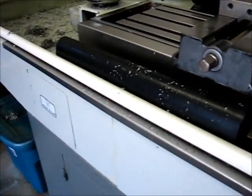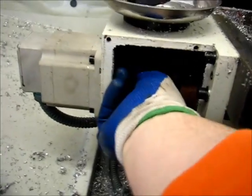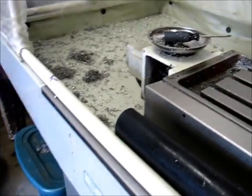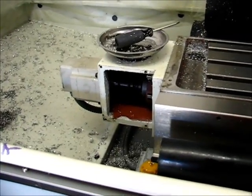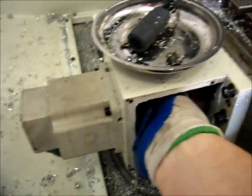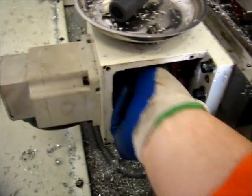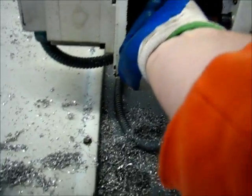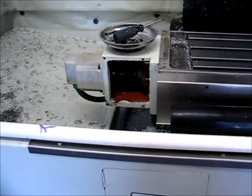Might as well check the jog wheel to see if it works still. One of the things they say to check is whether the stepper motor can turn freely by hand, or whether the problem is with the axis drive portion or the ball screw. I'm turning it by hand — so that sort of answers that. But to be sure, I'm going to disconnect the coupler right there and then run the motor on its own.